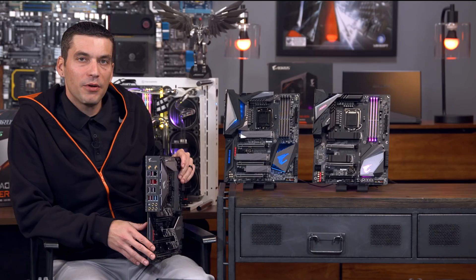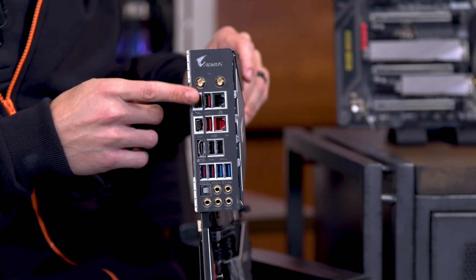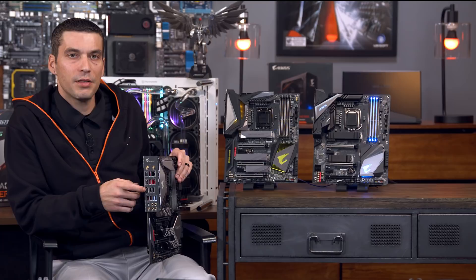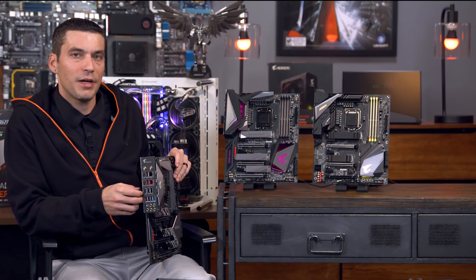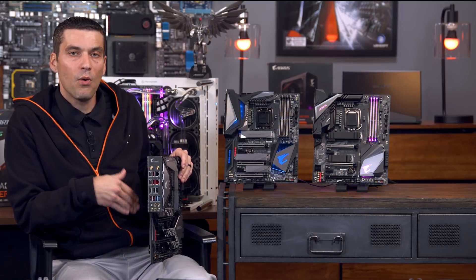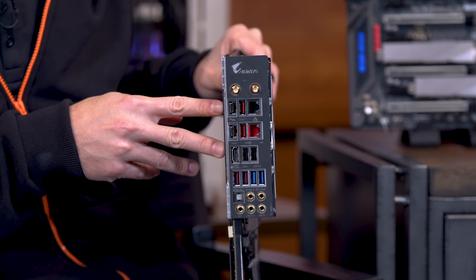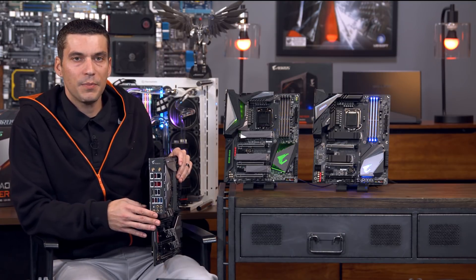And of course, the two 8-pin power connectors. This board is chock full of different I/O options. You're going to see the Intel 2x2 Wi-Fi at 1.7G — actually a little bit faster than your LAN ports in download speed. Right next to it you'll have your standard 1G LAN. And then this cool red connector is actually a 10G port — we introduced this on a board a little while ago, it got some pretty good reviews, so we decided to bring it to the mainstream Z390 chipset. This allows you to plug into a home router that has 10G, see what file transfers are like in your home office, or just give you future proofing. Even though it's a 10G port you can still run it at 5G, 2.5G, or 1G — it's fully backwards compatible. That gives you two LAN ports. On the side you'll notice two USB Type-C, but they're not just any Type-C — they're Thunderbolt 3 connectors. For the first time we're introducing two Thunderbolt 3 connections. They are Intel Thunderbolt 3, and if you're a content creator or constantly moving files around, this can really speed up your transfer times.